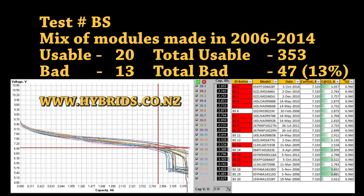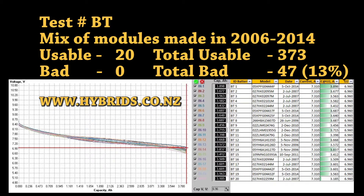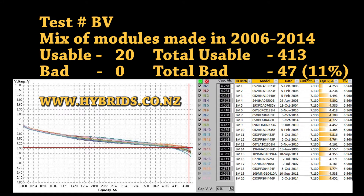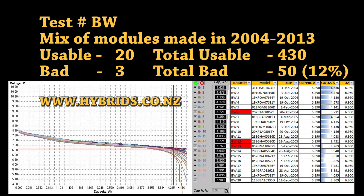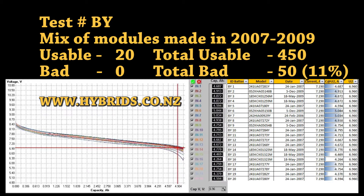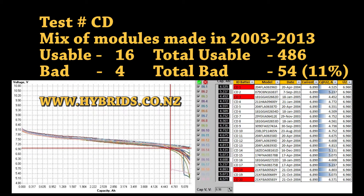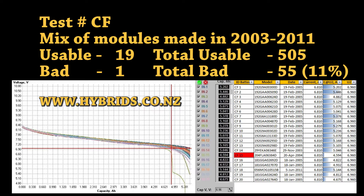Test results are automatically recorded into a database and displayed in various graphic formats. Load tests were conducted on one of our 20-channel battery analyzers under a 7A load; higher load can be used if needed. You may wonder why test results show capacity of about 4Ah on average. The fact is, we do not charge modules too high and do not discharge them too low. We use a 2kW 7A load in our tests.